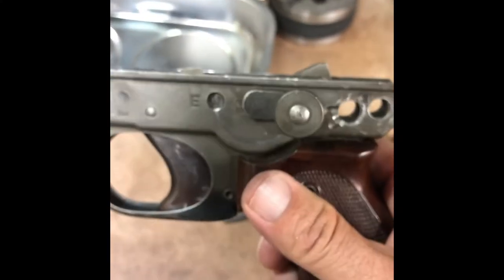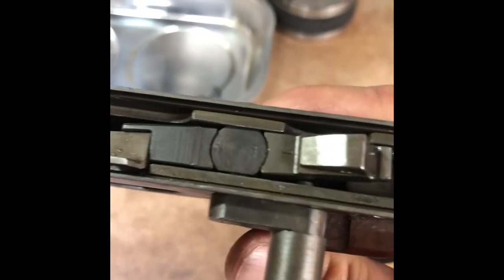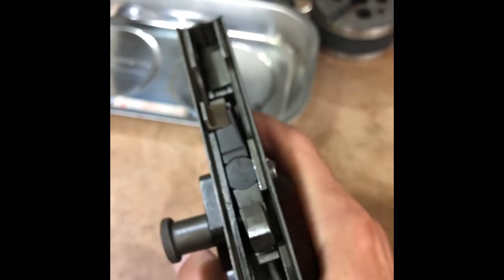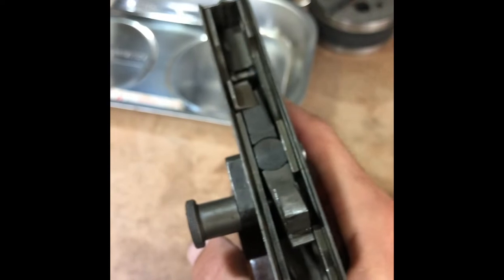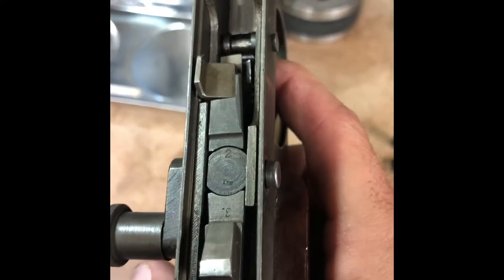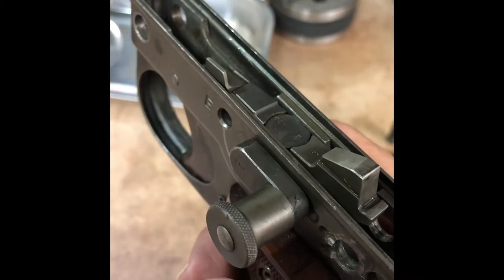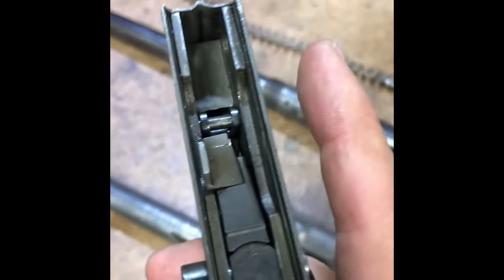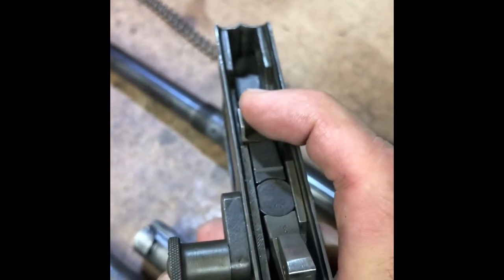Here's your fire control group in the pistol grip. Full-auto is forward, semi is to the rear. There's your disconnector and there's your main sear. When you pull the trigger, your disconnector goes up and your sear comes down. I haven't quite figured it all out yet since I'm still messing with it, but it's just a big chunk of metal with a couple springs. You pull this out and rotate it down and forward to go to semi — that reverses it. In this position your disconnector is actually out of the way of the carrier. And of course your full-auto sear is right there.